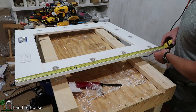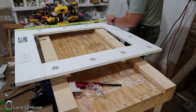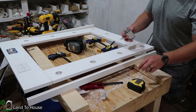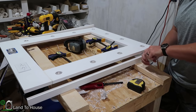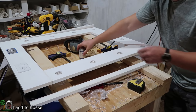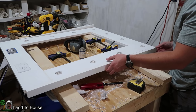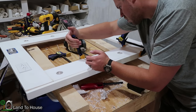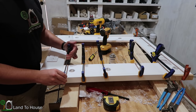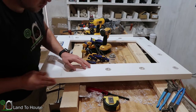I need 38 inches and 38 inches for the side trim. With the side trim cut, I'm going to be attaching it with the same Azek bonding I used before. It's just a matter of getting it turned up here and using clamps to make sure it is nice and secure. The clamps have sat overnight for 24 hours — time to remove them and see the results. Looking nice — it is definitely glued on there well.